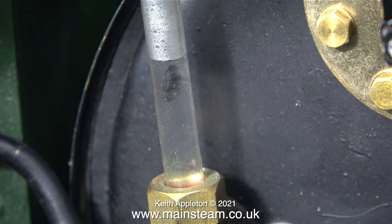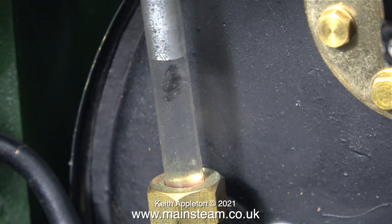I don't think this is actually a physical problem with the valve. Either boiler impurities or maybe some Loctite 542 is stopping the ball from moving inside.